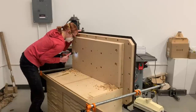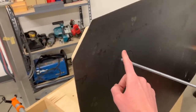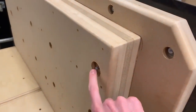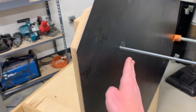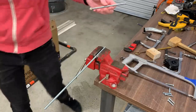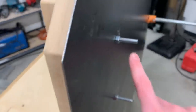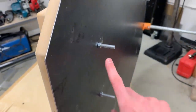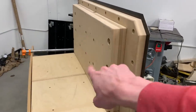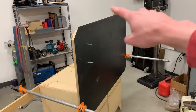The way I'm going to mount the lathe through this pan is using a threaded rod that goes through these holes, and the threaded rod will actually be welded into the pan — that way the pan doesn't have any holes in it anywhere so there's nowhere for oil to get through. On the bottom side this will just have a nut and a washer in the counterbore, and then on the top side the lathe will be held down by another nut and washer on the other end of the threaded rod. I have a big fender washer and a lock nut on the bottom side, and for now just a nut holding them up, but once I get to the welding step I'll replace it with a solid bead of weld all the way around. There's nothing else I need to do on the bottom side, so I'll tip this back down, put in the motor bolts, and move on to making the frame that goes around the perimeter.